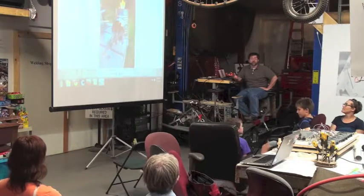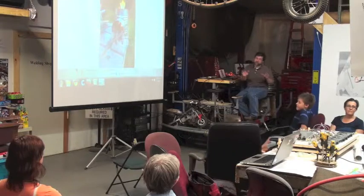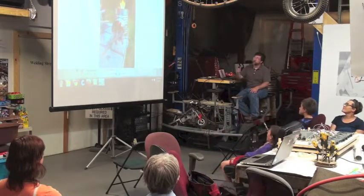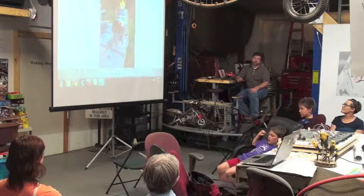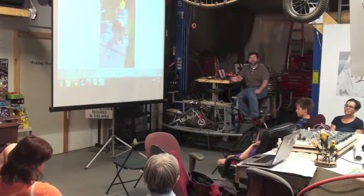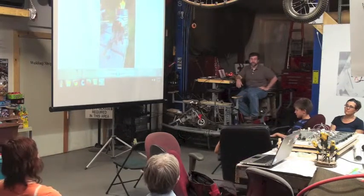I think the insulation was fine, it did the job, and we wanted it to be low tech, just steel cans and that's it, basically. There's 3 rivets in there to hold things together, but mainly it's the cement, refractory cement. You could get higher tech with it for sure, but we wanted it to be really low tech. And it eventually did get hot enough that you wouldn't want to grab onto the outside.